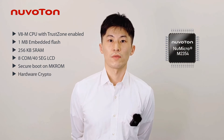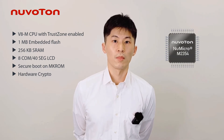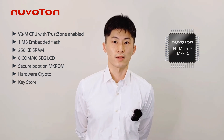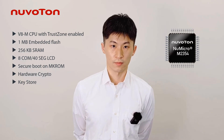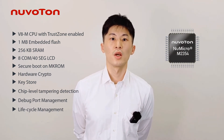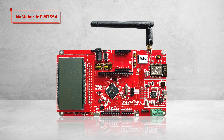The circuit board ensures the legality and integrity of the running firmware. The hardware crypto with RSA, ECC, and AES accelerators can help the device connect to the cloud fast and safely. Moreover, the M2354 is equipped with a keystore, which could be used with crypto accelerators to enhance the chip security level. To compare with PSA certified level 3, the M2354 has implemented some countermeasures against non-invasive attacks like side-channel attacks or fault injection attacks. Based on these features, we think the M2354 is very suitable as a development platform for IoT devices.